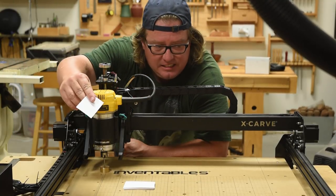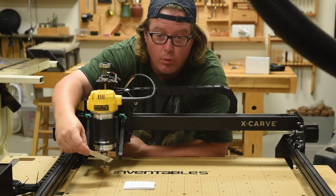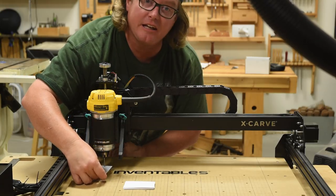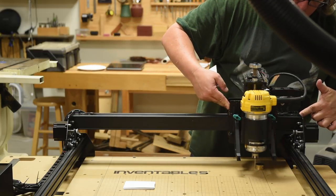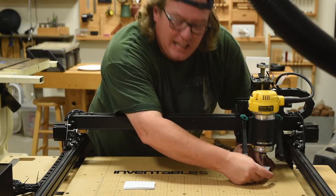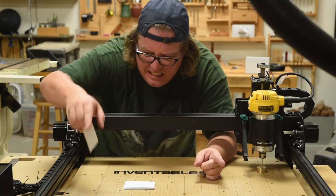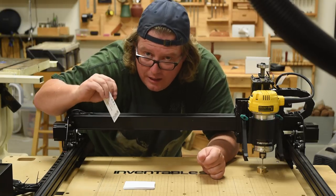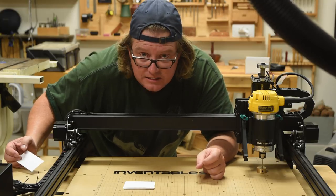With that done, I've got that side set and that side set. I didn't adjust any of the back sides because they were about the same, but I did re-adjust the spindle head so that only one card would fit through the new settings up front. And if everything worked out — yes — there's a little drag with one business card on this side, and this side's maybe a tad bit loose, maybe an extra half business card. This is good enough for what I'm doing. How long will these settings stay? I don't know yet — I'll have to fiddle around with it, but at least I know how much to add to just those sides to get it really close to accurate. Maybe I'll put some permanent shims underneath there for it to rest on so it won't go out of whack.